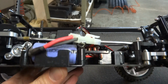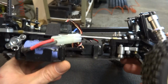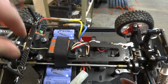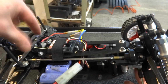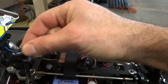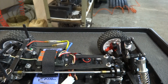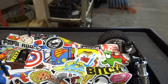The propeller shaft is also made here in house by me and my father. He was on the lathe and I made the flat by hand. This is a special fixture. I used the original holder for the resistor to screw this down and make this special. I think it's much sturdier for the chassis. These are holders from the TA02, because of the TA02 FRP plates I also received these, and I use these for the body shell to be much better, and you see it fits nice.